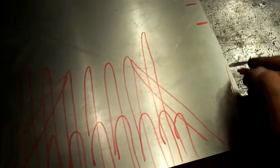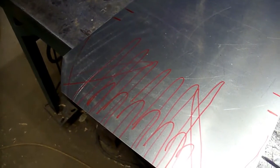We'll start to bring that in, and we'll start with a big sheet, and we'll cut it as needed. This is probably going to have to get cut, you know, like this and like this, but we want to keep enough so we can add our flanges in there and we have enough to hold on to and work with. So it looks kind of messy there, but that's basically the pattern we're going to take with our shrink dies.